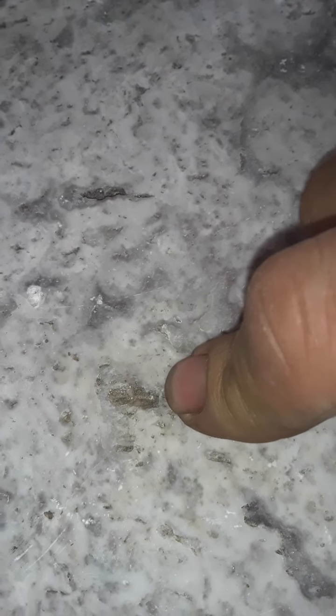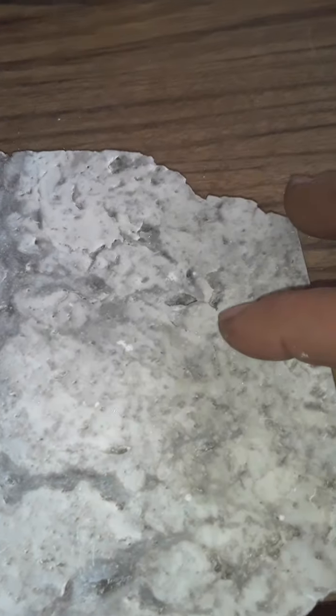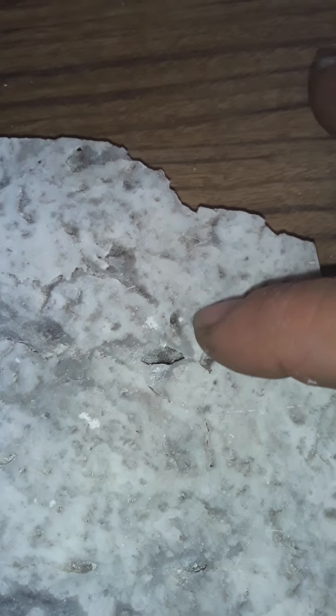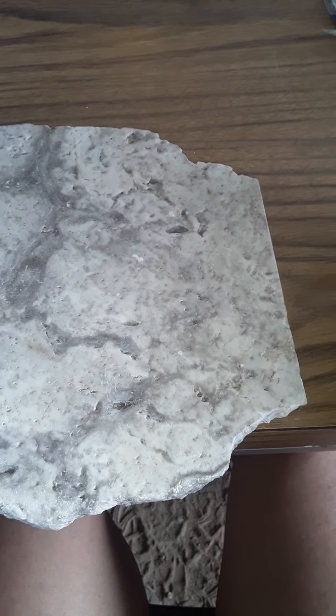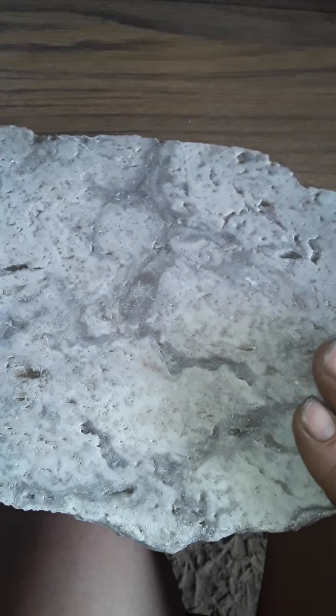A lot of travertine people like the vesicles — vesicles is a geologic term for these little divots. They like to keep them; some people fill them in. If you wet grind and wet burnish using a floor maintainer with a wet pad, these will all get filled up with debris and you're going to have a nightmare. So generally speaking, I try to get pads that are mostly dry grinding, and just use light fogging sprayers to get enough wetness on there to keep things fluent — not a lot of water, just a mist.